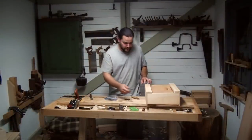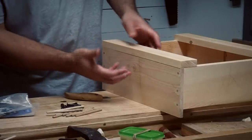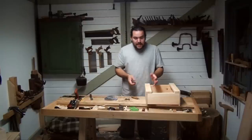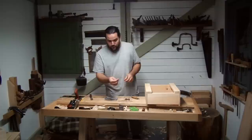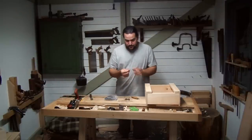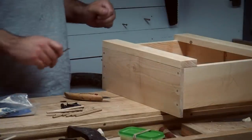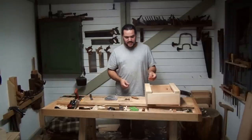I'm painting this piece — the pine's a bit scabby and I don't really want that on show, so it doesn't really matter what I use as we're going to cover it over. I'm going to use some oval-head nails. The reason I'm using them is that if I relied on glue alone I'd have to wait for the glue to dry and I'd have to have clamps on it. So if I just use the nails I can get straight back on with the next step.